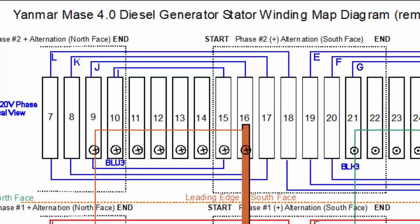Yet we still want the coils all in series. So we don't want to have to solder every coil to the next coil. We want to wind this continuously, wrap the first coil, do the spacing to get the jumper to go to the next slot, and then wrap the next coil. And it's going to be difficult, but that's the way it has to be done.